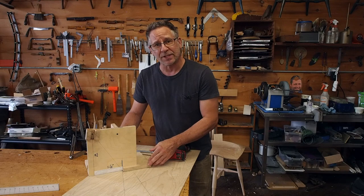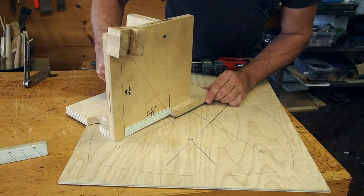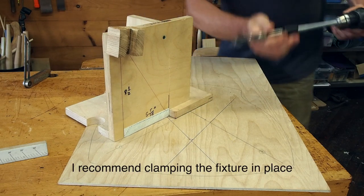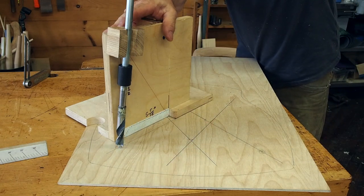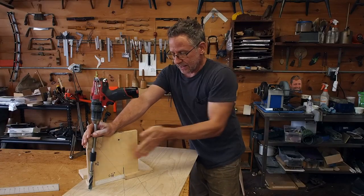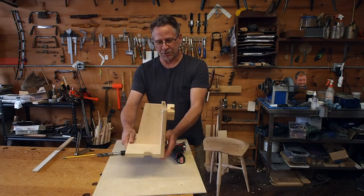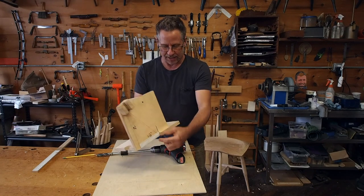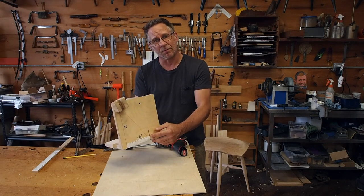It works a bit differently: instead of a number, I have a location along the sight line where I put a little red dot. When I align my fixture with that red dot on my sight line, I put my drill bit up into the fixture right here, and it gives me exactly the correct angle leaning along that sight line. The fixture is pretty simple — just two pieces of plywood with a little brace at the back to keep it square, a swivel block, and a stop block, which is my alignment point that I line up with the spot on my sight line.